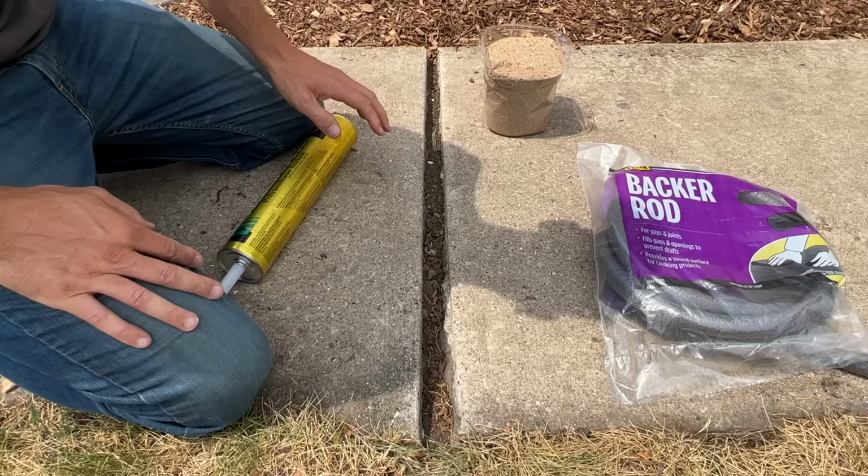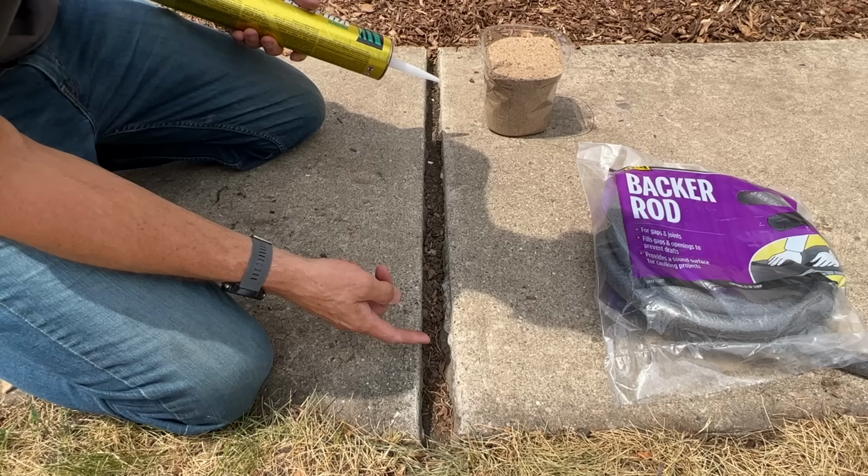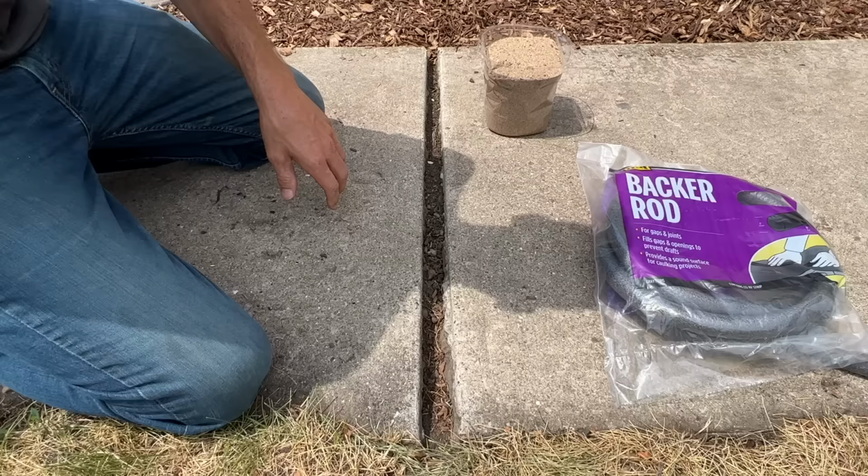And if you have just a little bit more of a slope, it'll still fill that gap and result in a solid seal. But this is why we clean up that surface, so the Vulkem 45 SSL will have no problem adhering to the concrete, making a great seal. And there is one small tip at the end, which I'll show you to help blend it.